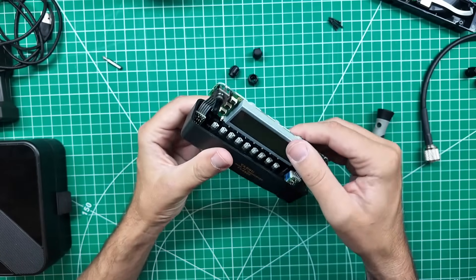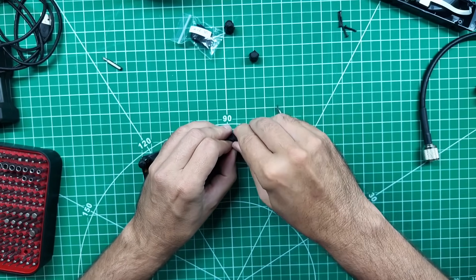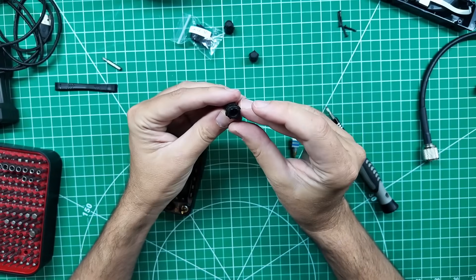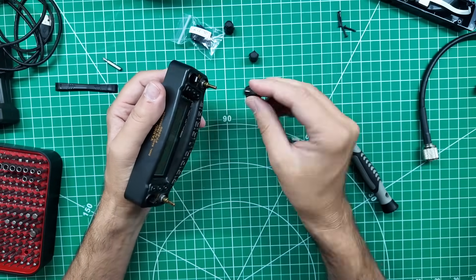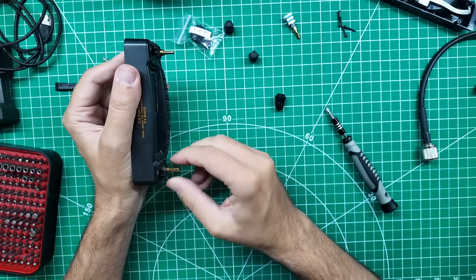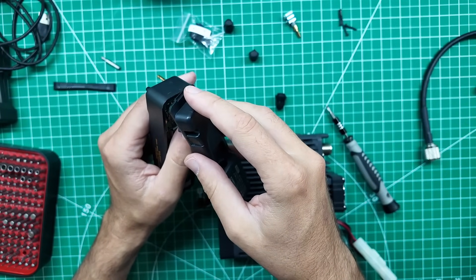So I was right — those are connected there, and that is a little mini circuit board. One, two — this one here is the one that's broken. This one is still fused together even after taking it apart. The outer one twists just fine, the other one twists just fine — so it's something wrong with the knob. I might be able to get away with not replacing the encoder part. I'll put that in my drawer full of spares because now it's turning just fine. I would rather continue to use original factory parts for everything, so I'm going to put this thing back together on the workbench and verify that it's working. If it is, we'll put the knobs on and call this one good, and I'll have a spare part.